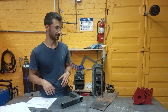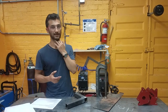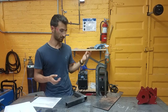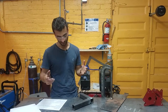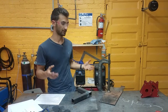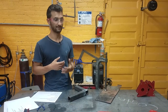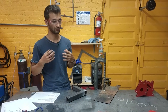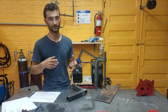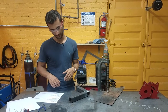In comparison to an oxyacetylene cutter, the plasma cutter will work on any metal. The oxyacetylene only works on ferrous metals; this will work on anything conductive. This isn't welding — you're not putting things together, you're separating them. But similarly, it creates a very, very bright light, so you need to make sure to protect your body, your eyes, and your hands. We'll get to that in a minute.